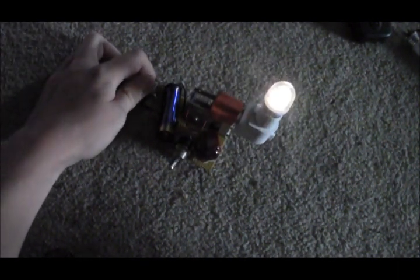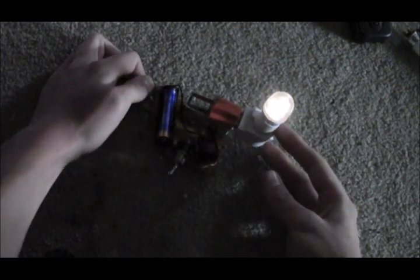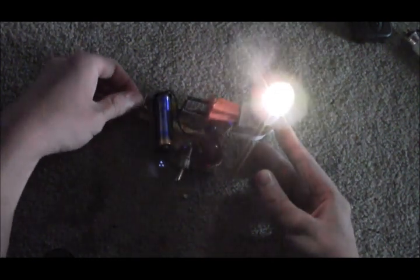It's illuminating most of the room. You can see I can turn this potentiometer knob to control the current being consumed — that's maybe about 50 milliamps, about 100 right there, and then full brightness at a couple hundred milliamps. That'll last for about three hours on this light because it's not drawing a ton.